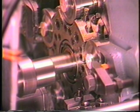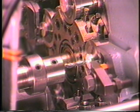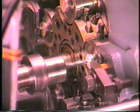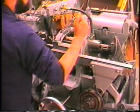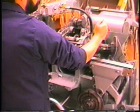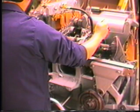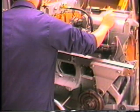This drill may be set at the end of its travel, the highest point of the drill cam. Once the drill is properly set, the point of the drill should be marking the bar end. The drill must be advanced with the turnbuckle until it is properly positioned. It will be necessary to jog the machine with the hand clutch disengaged once the point of the drill comes in contact with the bar end.